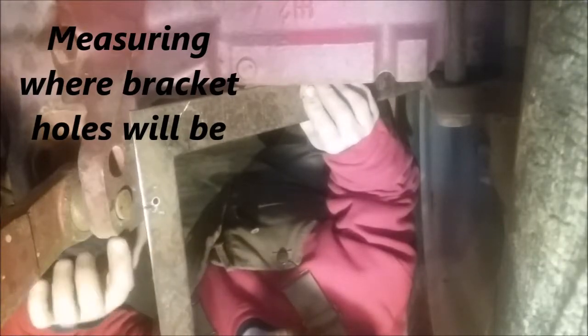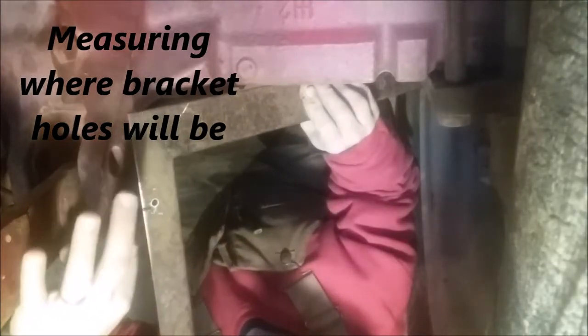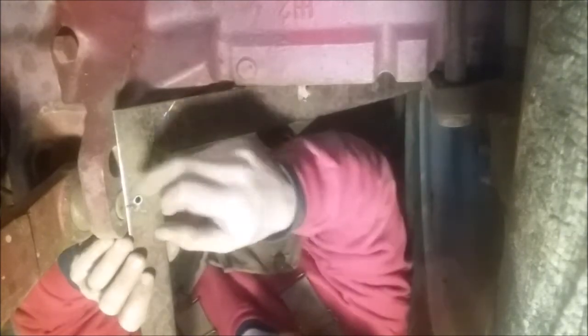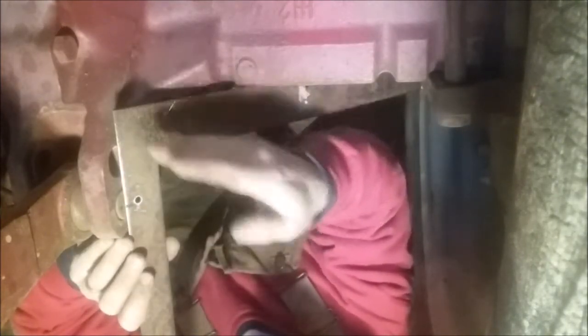This is flat on the axle. This pin is marked halfway up. Now I'll just put it right there. All this is telling me is the up and down, how low this pin needs to be where I drill the hole. The next measurement you're gonna need is from here to the axle back here. Do this part right and take your time.